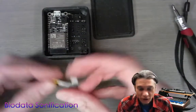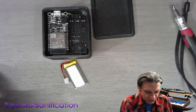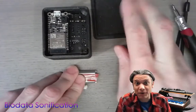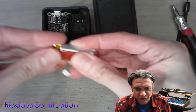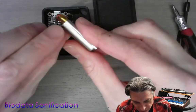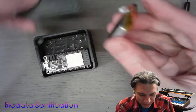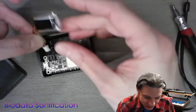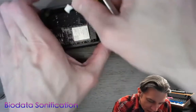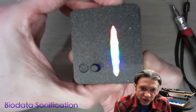The last thing we need to do is get our battery inserted. I use a little bit of two-sided tape — here I have some 3M VHB that I'm going to put on one side of the battery and then attach the battery to the bottom of the enclosure. This 3M tape is a little bit like jelly rather than being super thin, so it gives a little bit of impact resistance and allows us not to have that LiPo battery just flapping around. Before we stick the LiPo battery on there, let's plug it into the JST connector — there's only one way that it can connect in there. Then if you flick the power switch, the device should be able to turn right on.